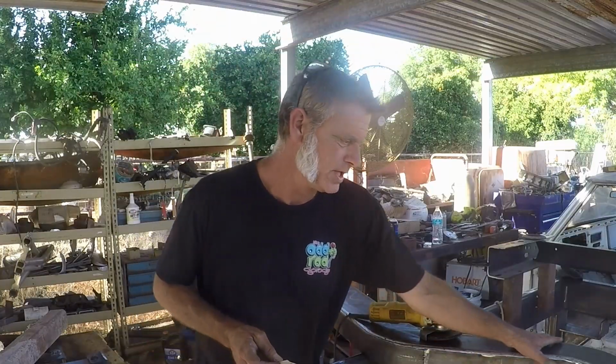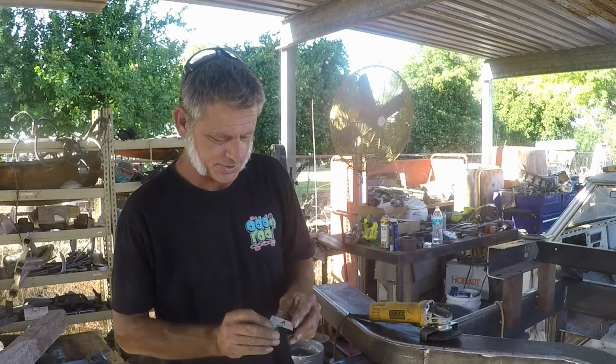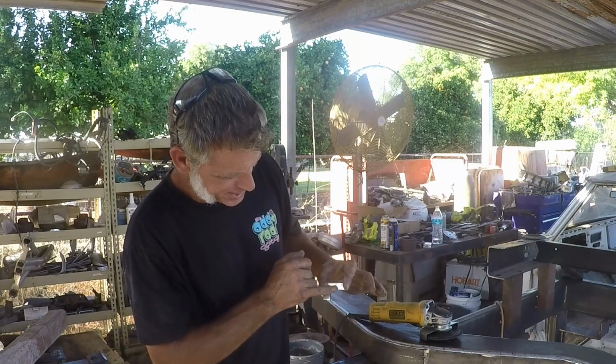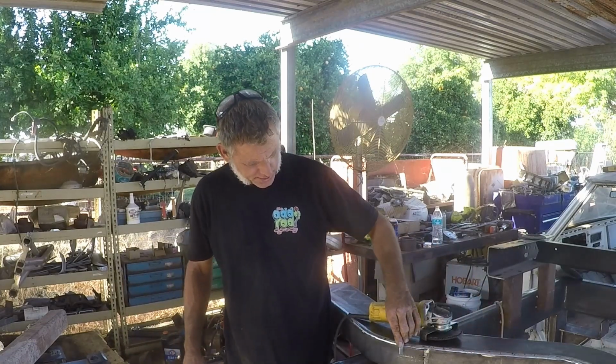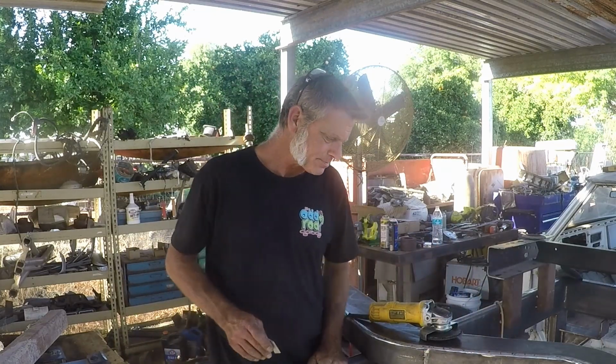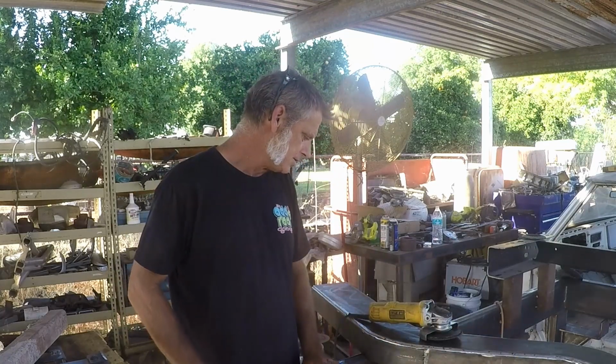Alright guys, so obviously we're doing rounds, and the top edge of the frame is round, as is the bottom. They are symmetrical, so that's kind of cool. Went ahead and just made a little toothpick out of aluminum. This is our radius right here. So just periodically running along here, checking for angles, because again we do want this frame rail to look nice. And as long as I don't gouge it, we'll be doing good.